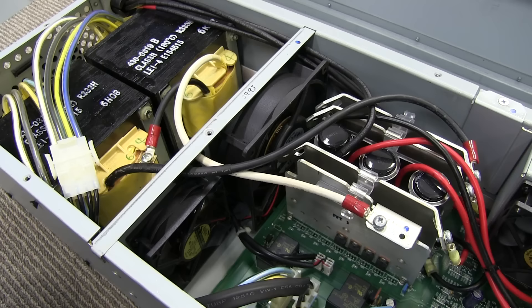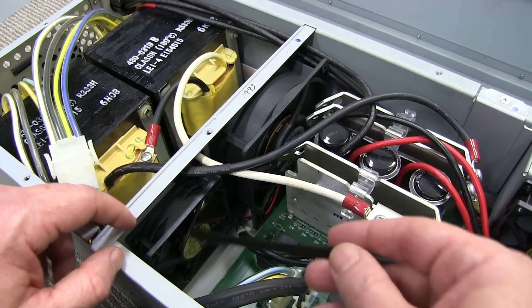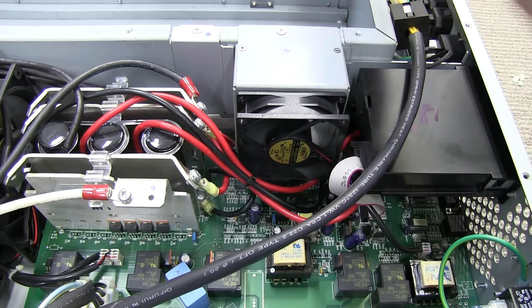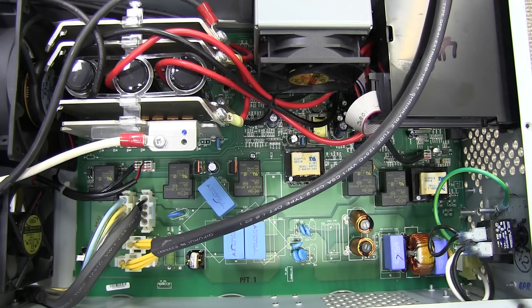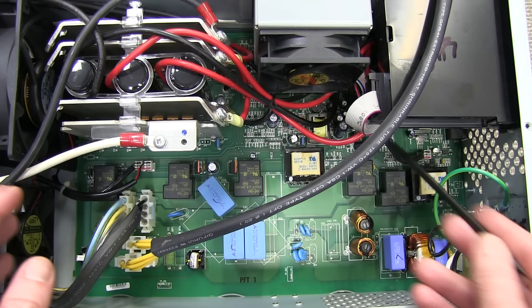It does appear that the internal battery pack is just wired in parallel with the cables which go off to the Anderson connector output. So all the battery packs when you use external ones are just all wired in parallel — positive and negative, no smart sense wire. Now as for the main board down here, there's just one board — a combination of surface mount and through-hole, single-sided. We've got our mains input over here securely clamped down to the chassis with earth. And remember, because this is a line interactive UPS, it is not isolated — the transformer is an auto-transformer, so the mains output is not isolated from the mains input.